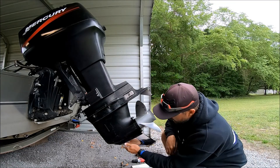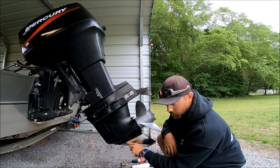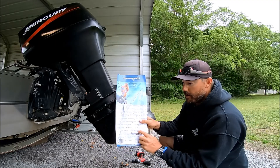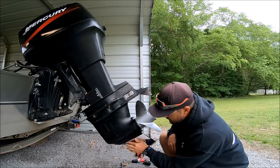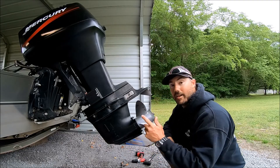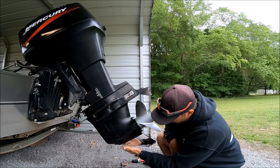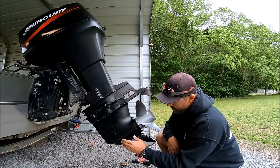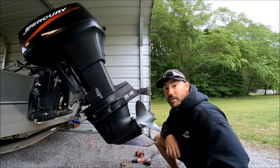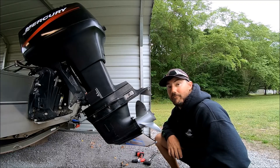The installation is done. I just take the screws out, put some red Loctite on them, tighten them up — it comes with the red Loctite right here — then let it sit for 24 hours and it should be ready to roll. Thank you for watching — that's how you install a skeg guard. It's a really cool product made of stainless steel and it will protect your skeg if you do a lot of river fishing and hit a lot of stuff. I'll see y'all next time on Gunfish TV.